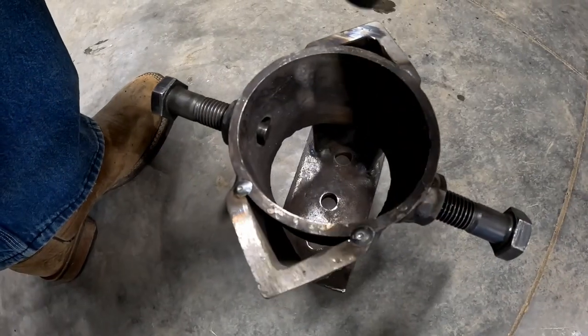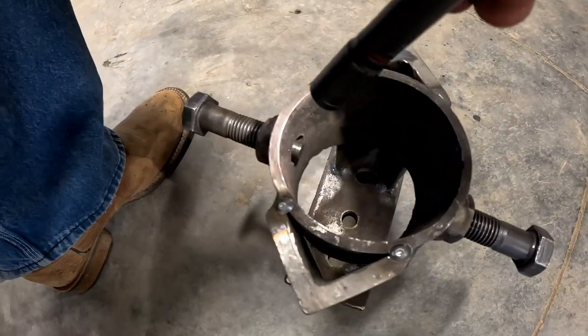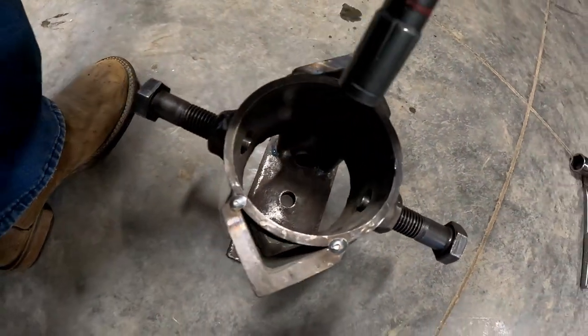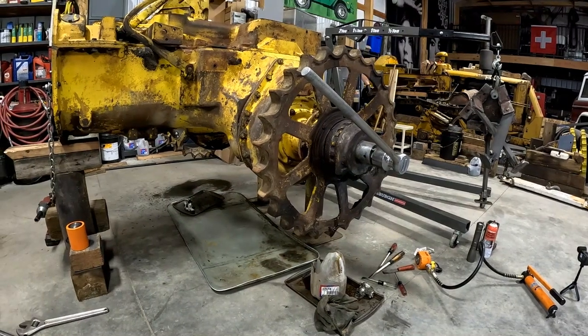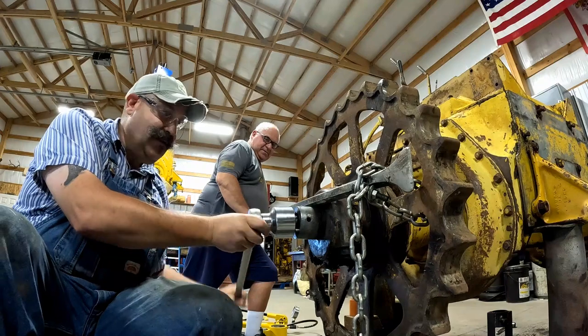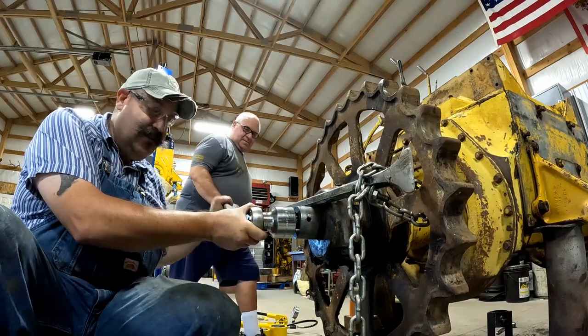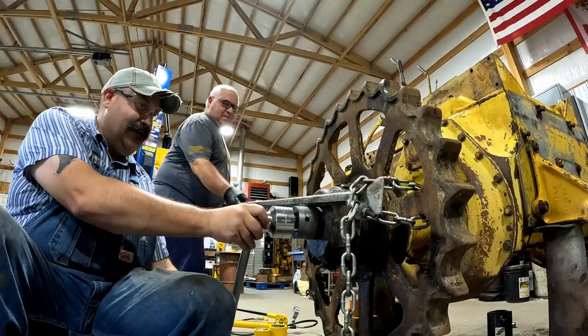This is the tool, and those are the bolts that we've machined down to screw into the holes on the pillow block, and we're off there. We just got to get our nut loose and pull it off. Had our nut on here too far and it got in between those pins that help lock the nut on the pillow block. I think you're home for sure.